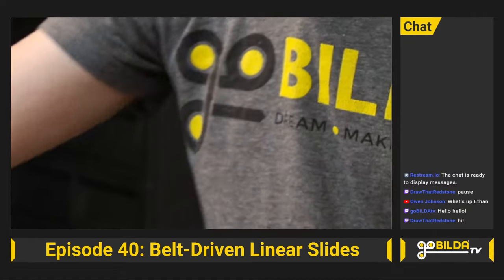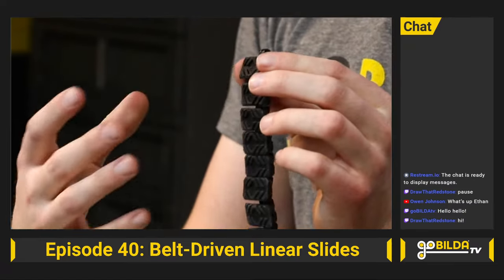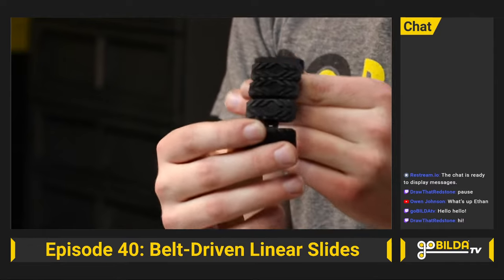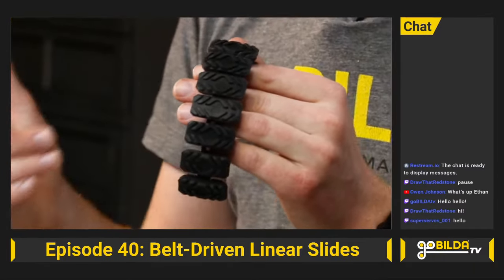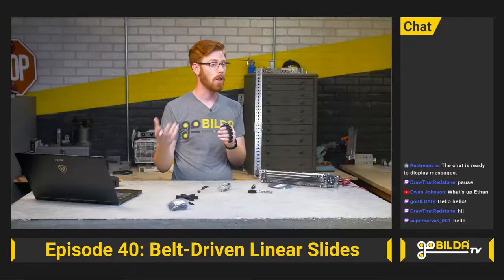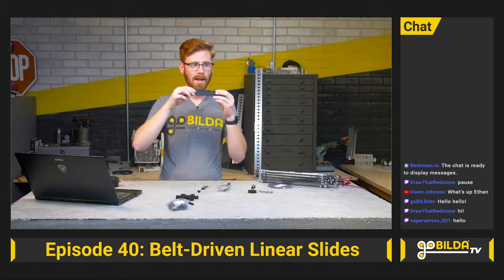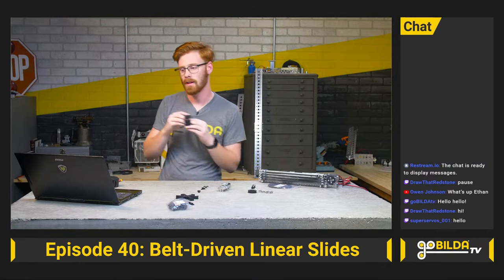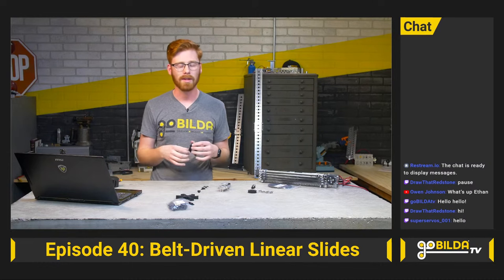We also released our track chain — called Tumbleweed Tracks. It uses those grid chains and has rubber slip-over socks that fold over the plastic paddle you can bolt things to. These are a 50A silicone rubber, very grippy, and they stay on really well. For small-scale robots — smaller than you'd see in FTC — this is a really sweet drivetrain. In FTC, especially when you have an element that can compress, these are a great way to move it around your robot or from one end of the robot to the other.